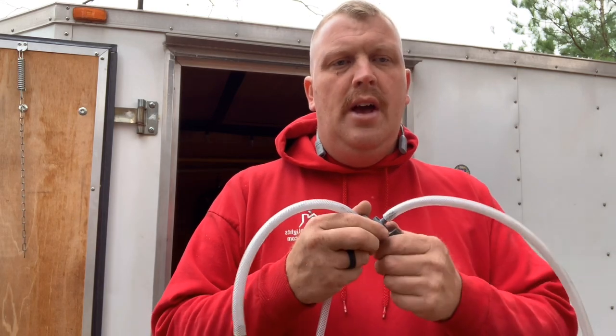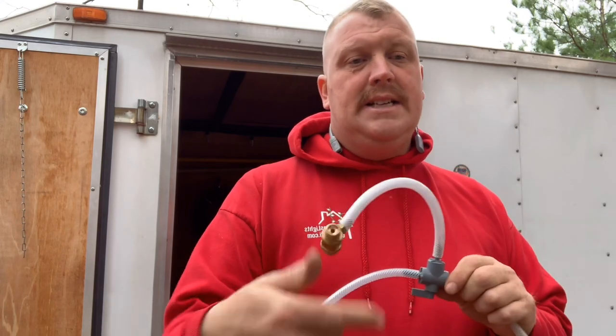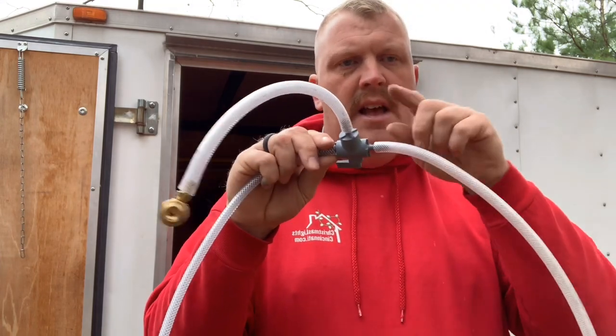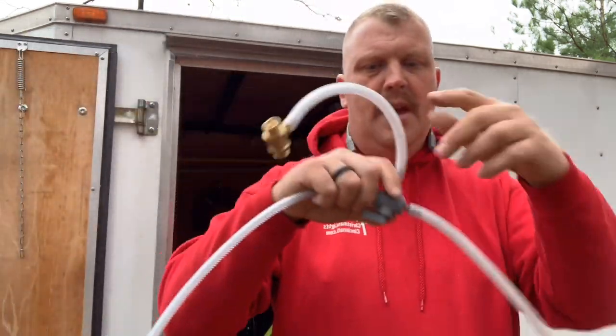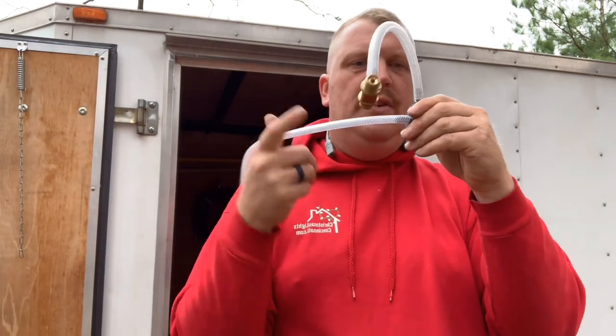When I'm on soap, I can turn my valve to water and now it's actually flushing my downstream injector out. That way, I'm not leaving soap in there for that spring to start rusting and eating away at my downstream injector. So basically, one hose goes to my water tank, the other hose goes to my soap tank, and I use my three-way valve — when I want soap I pull from the soap tank, when I want water I pull from the water tank.